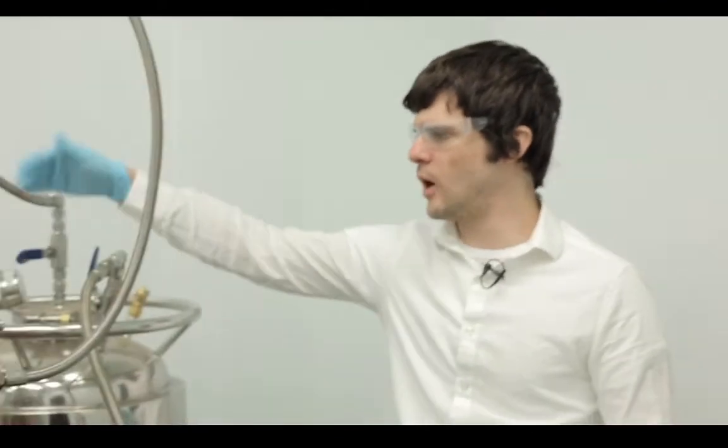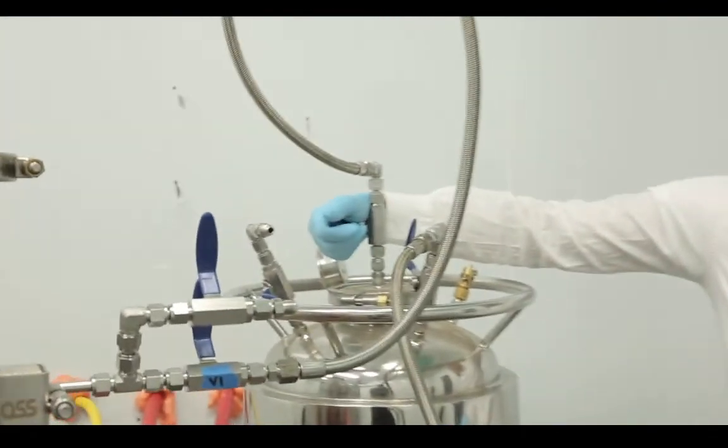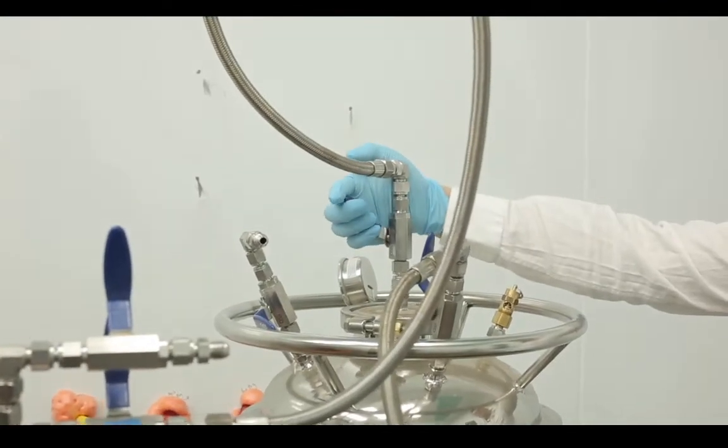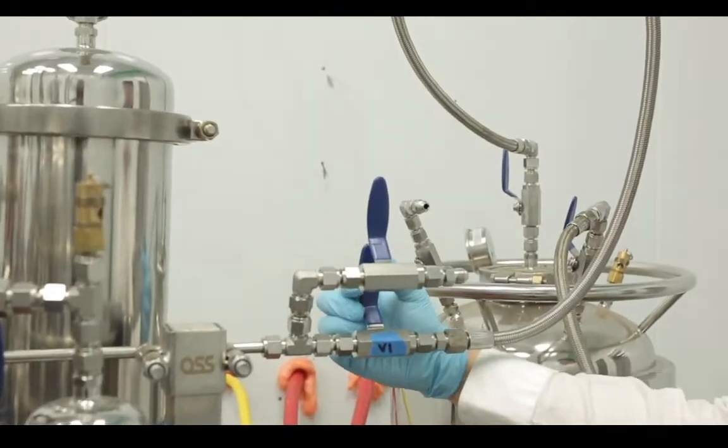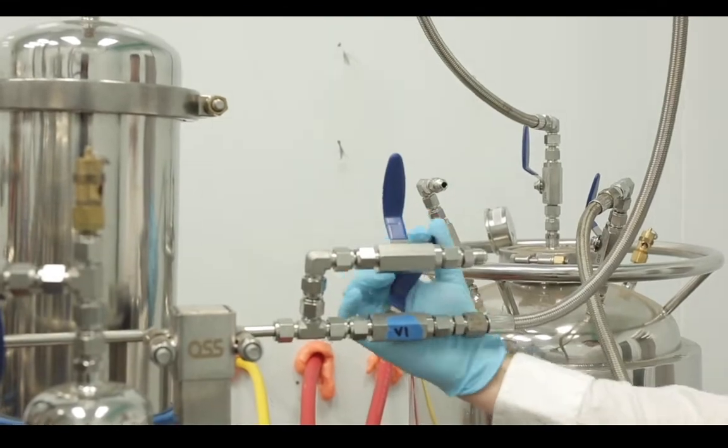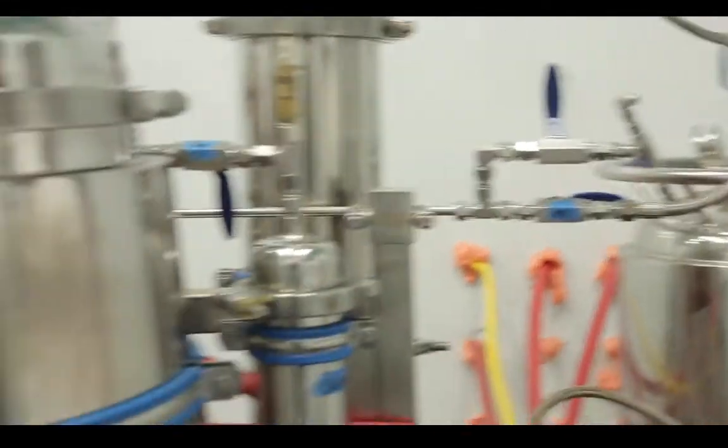We want to be around 2 pounds of gas per pound of biomass inside of the extraction column. So since we loaded approximately 6 pounds, we're going to go ahead and do 15 pounds through to just kind of overachieve a little bit. And the way we want to do that is we want to open up our injection ball valve into our injection column. This will charge the rail.